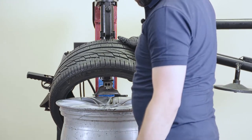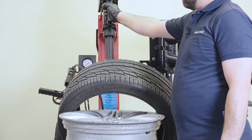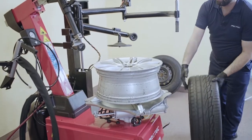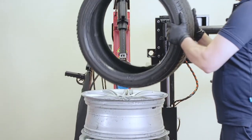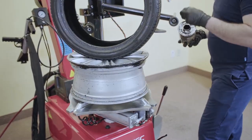So we demount the tire. Tilt the head back. Once you've set up the demounting head, you don't need to reset it again — you can do your thing. Clean the rim, replace the valve if you have to. Put the tire back and apply some bead sealer on the rim.